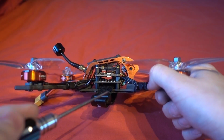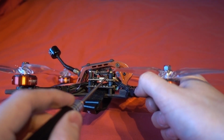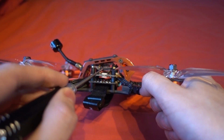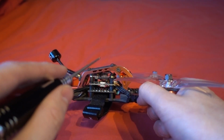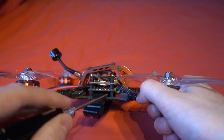And then we have got the Airbot F4 flight controller. It's got a 8-volt out for the VTX, and then we have got the iFlight iForce VTX, which is a switching VTX. It's smart audio and it goes up to 600 milliwatt.